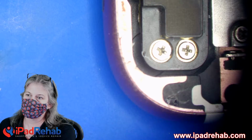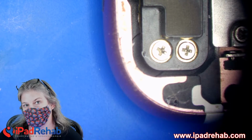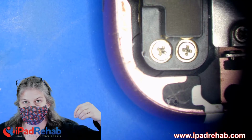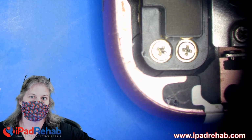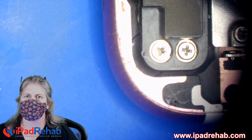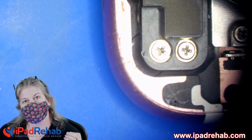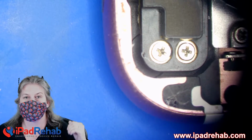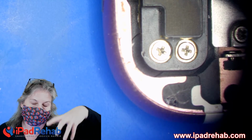So you're talking about, what if you could heal an open from the CPU to the connector by soldering a wire into the die of the CPU? And you absolutely can do that. You can shave down into the CPU, and I think there's a video on my channel somewhere where I was doing that in a race with the mailman. Like the mailman was coming, we had to do it quick. Really old video though. That's going to solve a problem where the CPU is intact but not making connection with the bottom pad. So it's an alternative to lifting up and reballing the CPU and putting it back on.